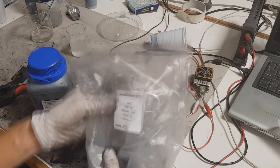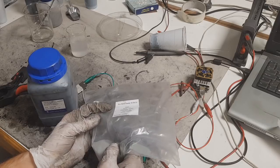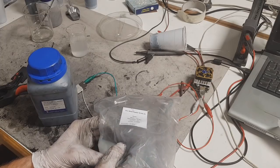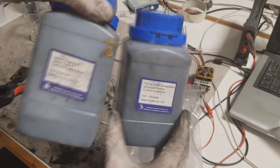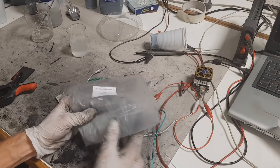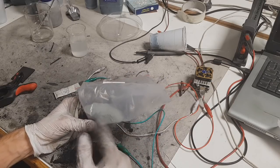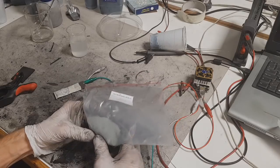Because if you add too much carbon black into the mix, you will decrease the capacity, and this is really important. So the really good way to make this electrode is to use 4.4 grams of zinc powder and 0.09 grams of carbon black. You can use whatever carbon black you want — these two are really awesome, and this one works slightly better than the other. To repeat one more time: you need to make correct measurements of each material — 4.4 grams of zinc powder and 0.09 grams of carbon black.